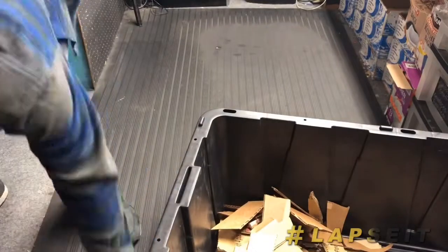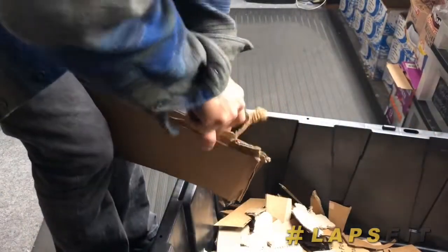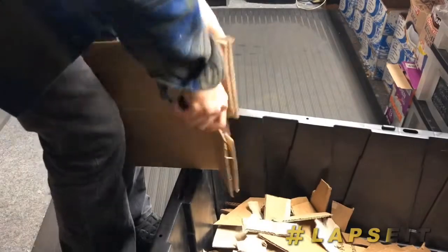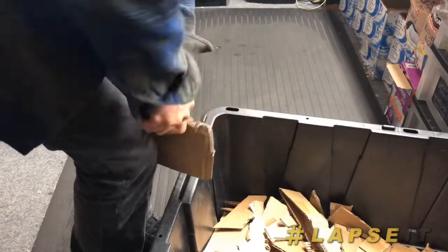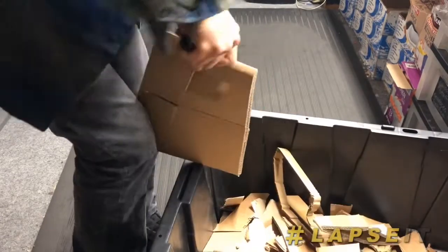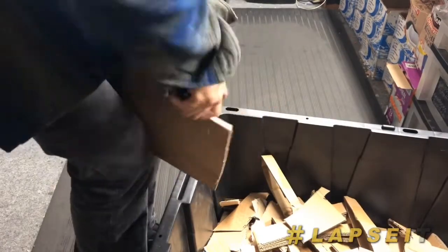I think the biggest thing, the BD1N took an extremely sharp edge, took a great edge right off the bat, and it was a joy to sharpen. It sharpened extremely quickly. I reprofiled it with 600 grit, which, I'm so used to sharpening these high carbide steels and much harder steels, and this felt like a breeze compared to all that. Of course, when you're sharpening nothing but 4V and M4 and 20CV and all these other steels that tend to be harder, with harder carbides involved in the cutting, this was like a breeze, and it sharpened really well. It was splitting hairs easily in both directions on first sharpening, so it did well.